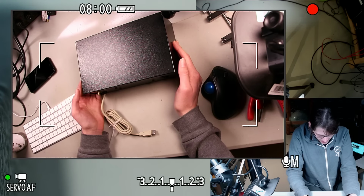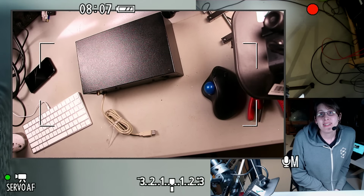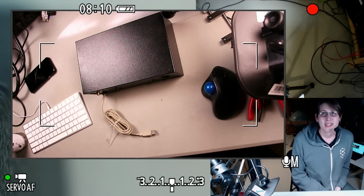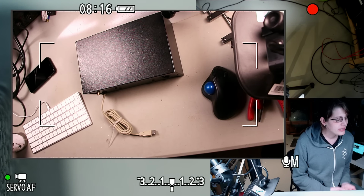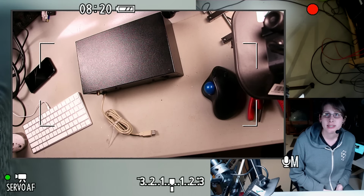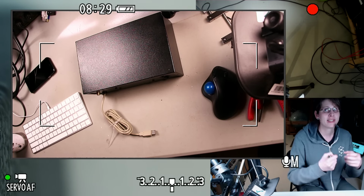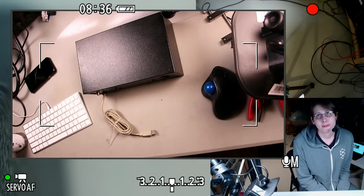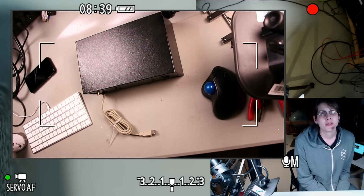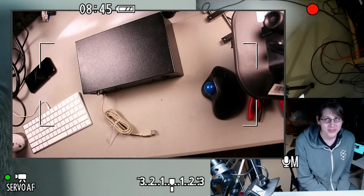Because it was using low speed, in addition to all the weird protocol restrictions, low speed does not allow you to use connectors on the device end. I don't know if anybody follows this for real, but very common low-speed devices are still mice and keyboards, especially ones without any fancy features. You'll notice they often don't have a socket on them, they have the cable wired directly in. That's actually a requirement of the USB spec: the low-speed protocol has different electrical impedance specifications for the wire, so you can't guarantee that the cheapo low-speed transceiver is going to drive whatever random cable you attach.